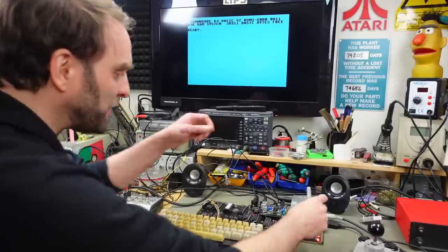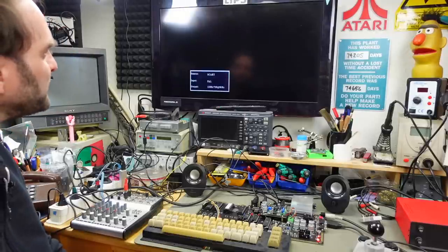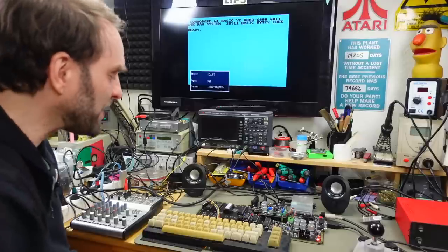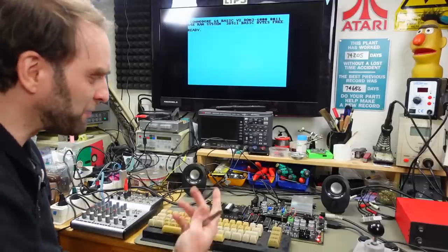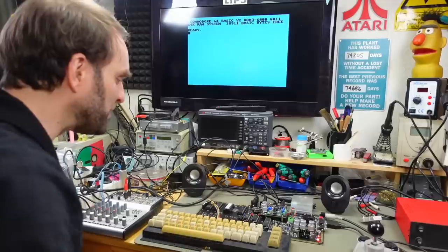So pretty nice. And you can of course combine these. So you can set this to this CPC looking font, should be this, yeah, and we have the different font there. And otherwise, obviously, the C64 should work just as it is usually working, just with different character ROMs and different kernel ROMs. Cartridges, there's also some example cartridges on here, I think, some games and stuff.